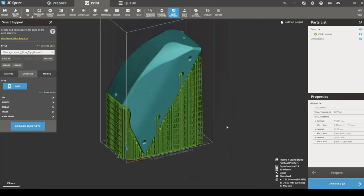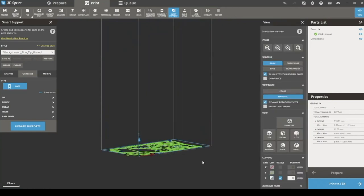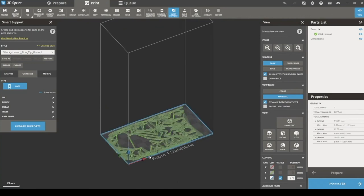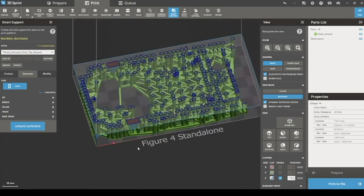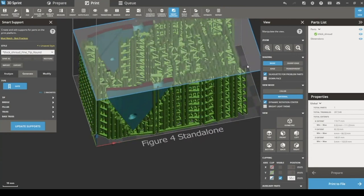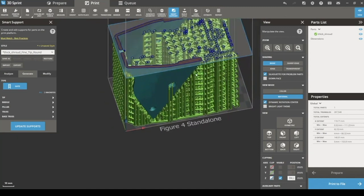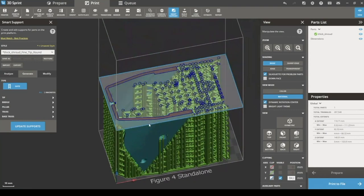When you have a rubber material though, I will point out that you're going to be using supports a little bit during the process to maintain the shape of your part. So you may have to use a little more supports than you normally have used in some of your more rigid parts. But one of the other things I'd like to point out, if I go in and use my clipping as we've done in modules 3 and 4, and start to raise my part, you'll see that your part starts in 2 different areas. And as you start to build that up, these parts are building, you're going to experience some slight shrink or distortion that you may get. And when those join at this point here, what you may see is a line in your part.